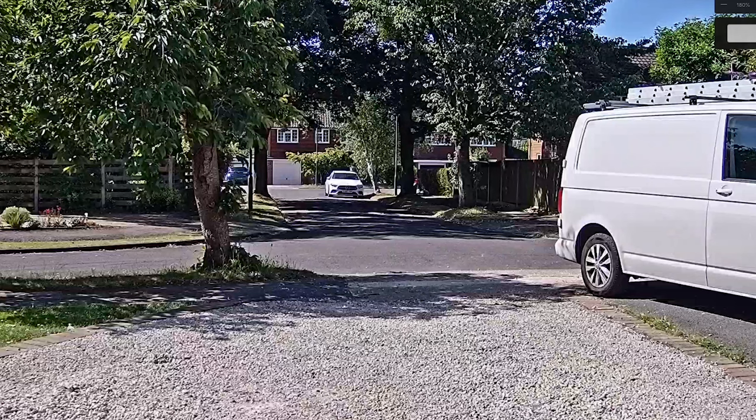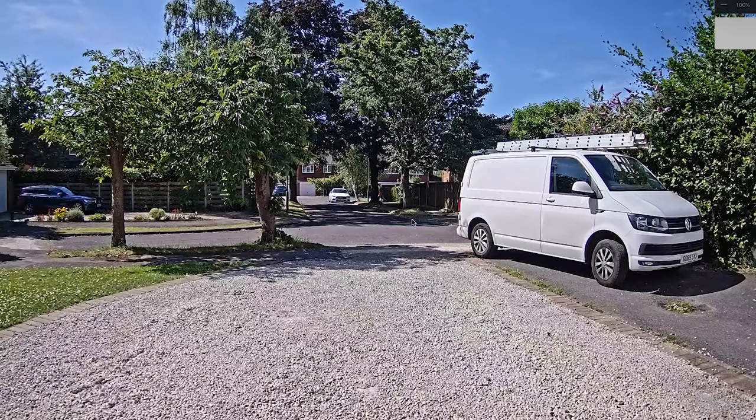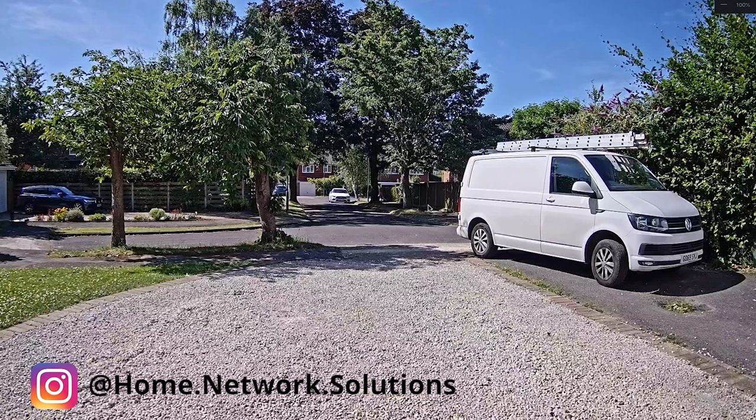If we wanted to read that number plate and we haven't used the optical zoom when the camera's in live mode, we can't then use the optical zoom to zoom into the recording, because it physically changes the camera's lens so that it's able to view into that area. So it's not something you can do retrospectively. You have to have done that focus on the camera.